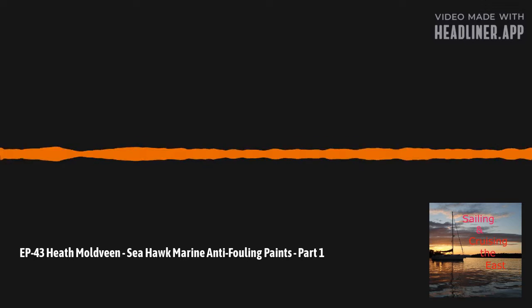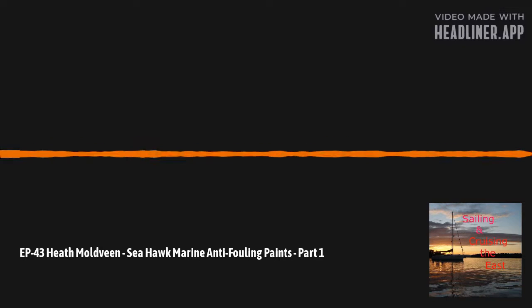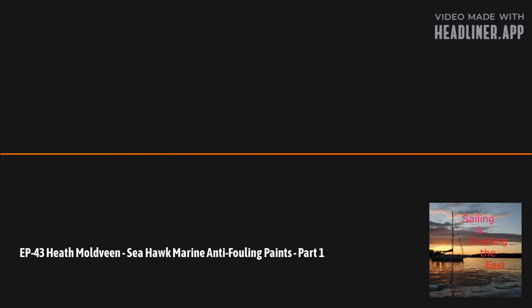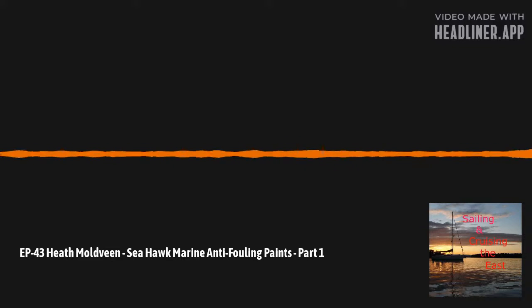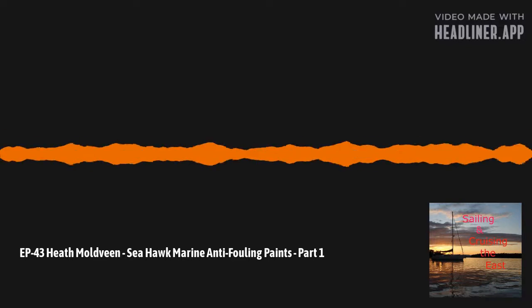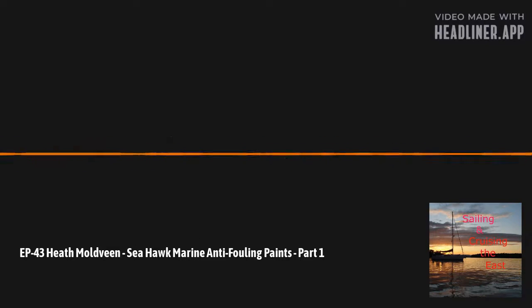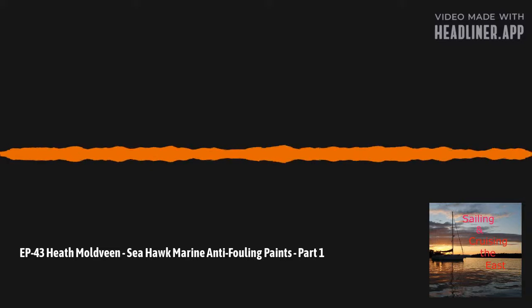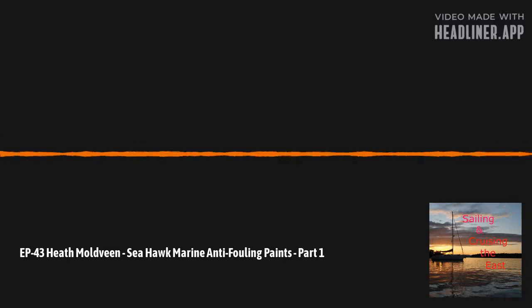Also, one of the most expensive parts of the paint is the resin. Resin's expensive, and resin denotes how that product wears, how it polishes, thereby also adjusting how the product releases protection, or cuprous oxide. And so there's a lot of choices that go into it, Bella. It's not a cut and dry thing, as we've discussed. You've got to really have a plan and know where you're going, or just be okay with spending a little more money than you want to spend, to have that top tier performing product. Right. So again, that financial thing kind of happens there with everything, right?